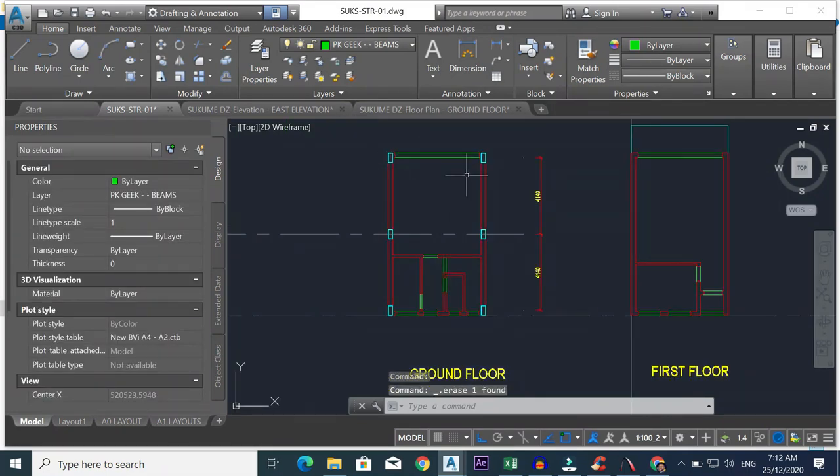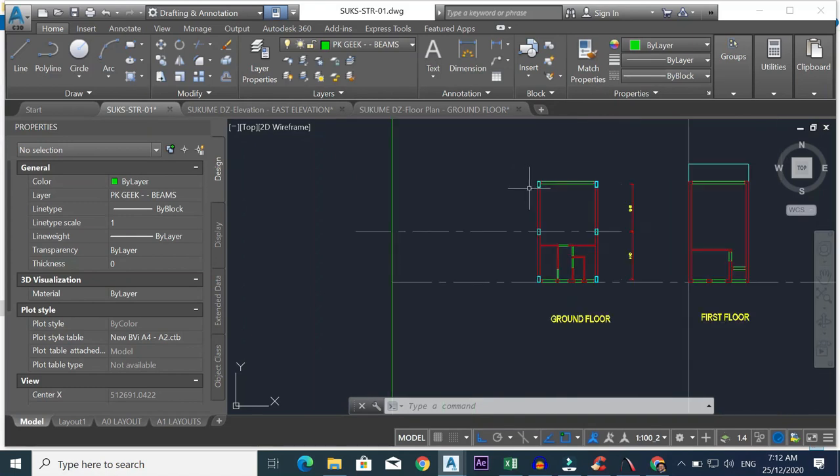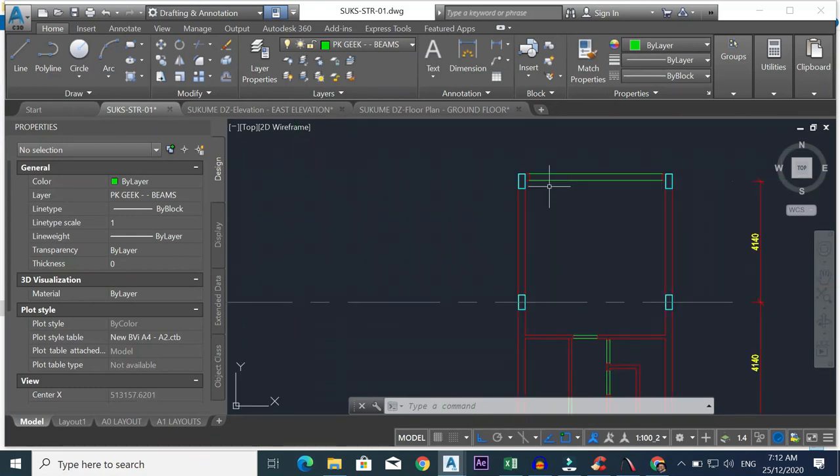So this is where our bases are going to go as well. For the bases, we need to size them. Normally sizing them is, you do your takedowns, but as I say, the minimum bearing pressure that we will use is about 200. From experience, what I've seen is a base which is normally 1500 by 1500 works. When we do the design later on, if it's too much, then we reduce it. If it's too small, then we increase it.